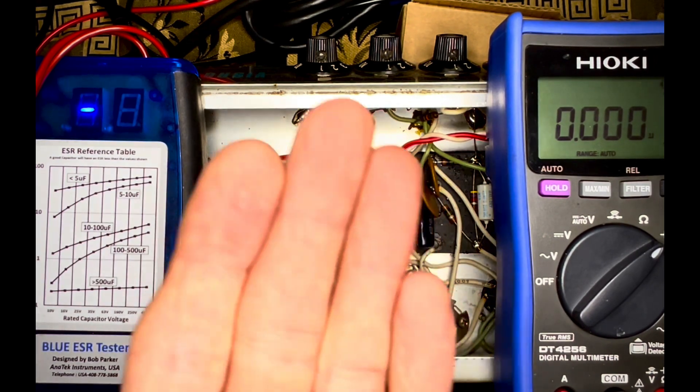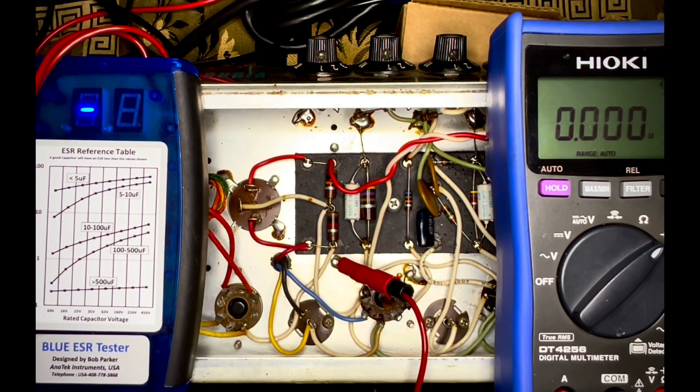I'm going to try to do this. I don't have much space in between to move about, but I can't go into great detail right now. But this is an ESR meter, and it's going to tell me if this capacitor can has any sections that are leaking or becoming a resistor, in essence. And the worst case scenario, it becomes a jumper in there and you get a short.